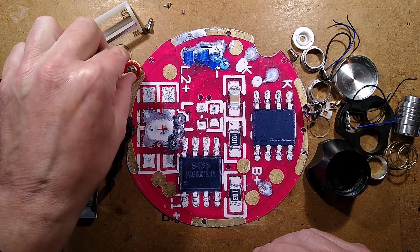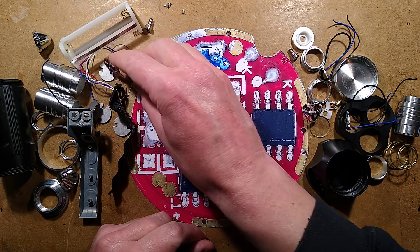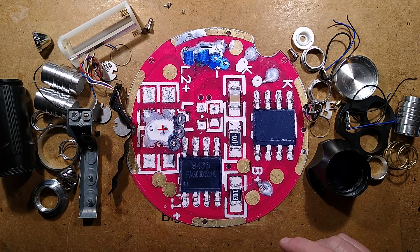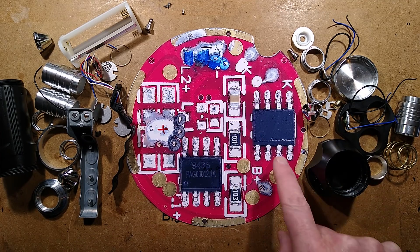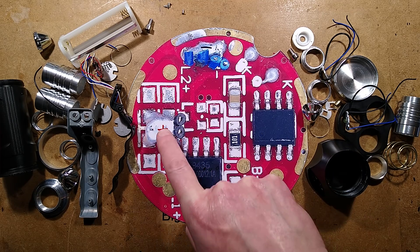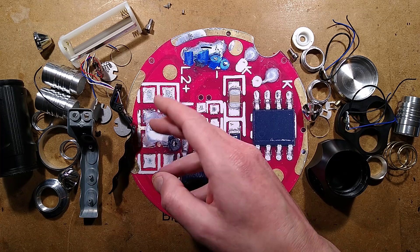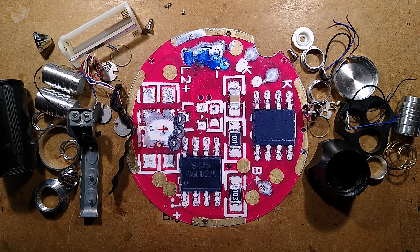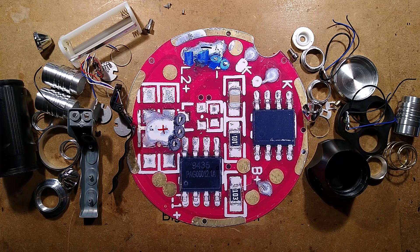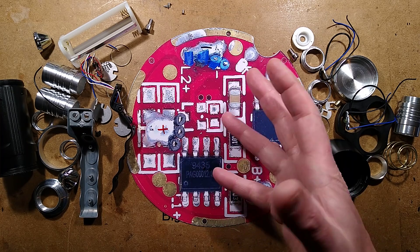What a strange design. I've completely stripped it, as you can probably see. The circuit board is very simple — it looks suspiciously as if it's out of a standard flashlight. All they've done is they've patched lots of wires onto the back, basically where resistors might have been in the past. The circuitry itself has a flashlight controller chip driving a MOSFET, and that then switches the LEDs. Fundamentally, there is absolutely no current limiting. There may have been resistors designed to be used in the past for other lights, but it's not been used here. I'm also not sure what these pads are used for — they're heading over to that flashlight-type control chip. I don't see any resistor in series.